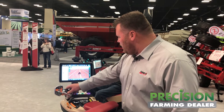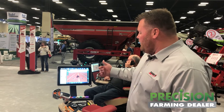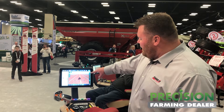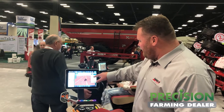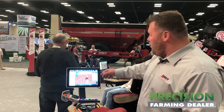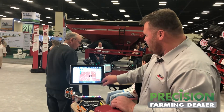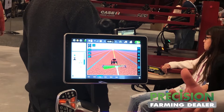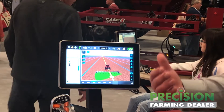From a guidance standpoint, the ability for somebody to get in and set guidance very quickly and easily is very important. This system is incredibly simple and intuitive to use. Start out with the swath manager, which brings up the different lines you can run — straight, which is your AB or a heading. I'll select heading, for example. It will always drop a line in the direction the hood is facing. You can type in a specific heading or grab the compass and move it around to project a different line. Your new guidance lines come in, you engage guidance, and now we're farming. Very simple to set up.